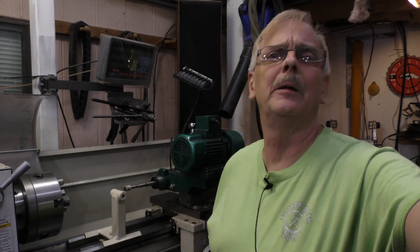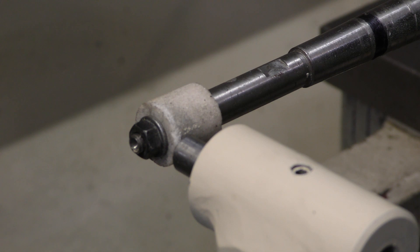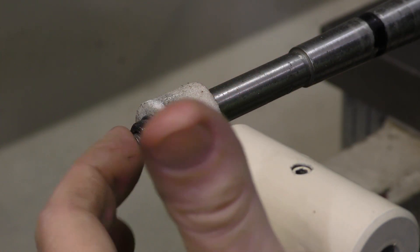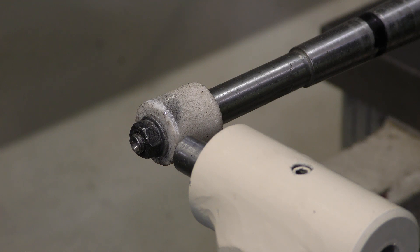I'm going to come back after I get power to the unit. You can see I was a little cheaty — I touched off on the diamond before we got started. When this grinder came, it had a black stone on it that was true, so I got pretty good results. But there was no thread-locking material of any kind on the arbor nut, and during the last attempt at a video I broke the stone inside the chuck and did some damage. So we're getting a new try. When I mounted a new stone, I realized it's not even cylindrical — coming out of the mold it's tapered; it's got a casting draft on it. To get it completely cylindrical and do a good job, it needs to be dressed with a diamond, just like the more experienced people have done with their surface grinders.